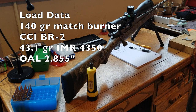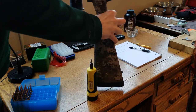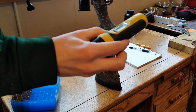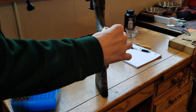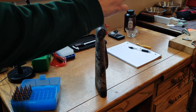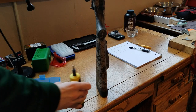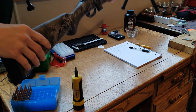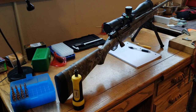The method I'm going to use today will be consistent throughout. I'm going to give the butt of the rifle two hits, then turn my torque wrench up to the target setting until it clicks on the front screw, then on the back one. I'll do that with all the settings today, progressively tightening — not taking the screws all the way off. Right now it's torqued down to 25 inch pounds.